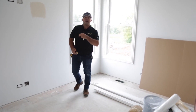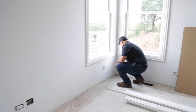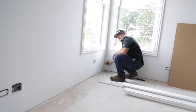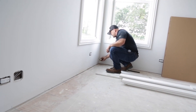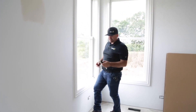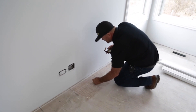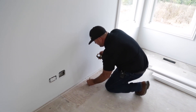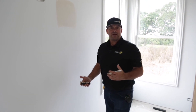This gives you the ability to shoot from one end of the wall to the other with great accuracy. I'll arm it — I've got it set for inches — and shoot a measurement at the other side of the wall. It comes up and tells me it's 216 and 5 eighths inches. I'm simply going to write down that overall number: 216 and 5 eighths. I have that dimension ready for my install.